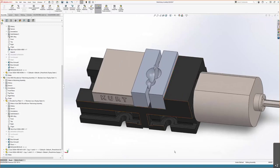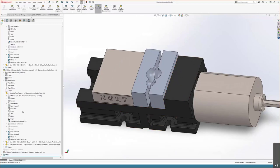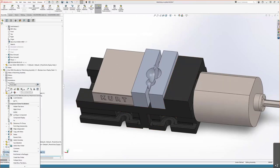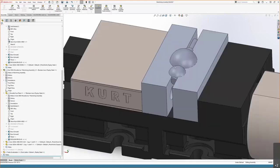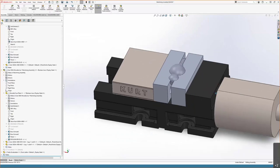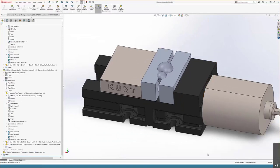And what's more is that I think this is a responsible way to model out our soft jaws and to generate G code in this SOLIDWORKS assembly setup. When we're working in that kind of environment in SOLIDWORKS in the assembly space, we don't really have a great tool to do those Boolean subtractions. It's easier to do it at the part level. So when you're in the assembly anyway, you might as well go ahead and design it. And that is also what I ended up doing to get the geometry on these.